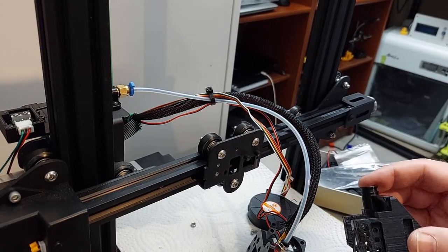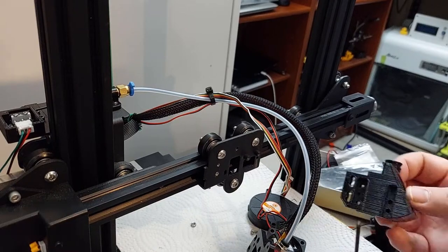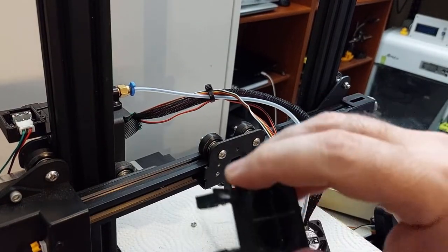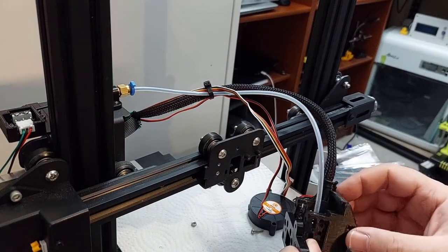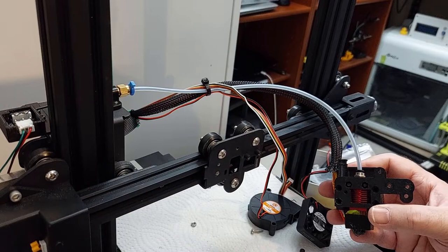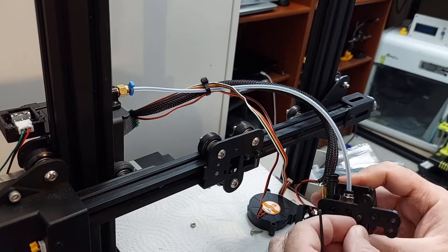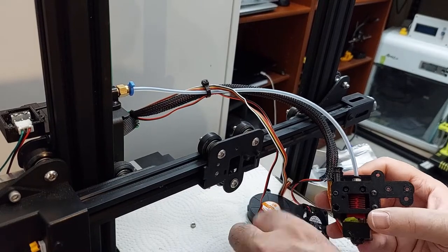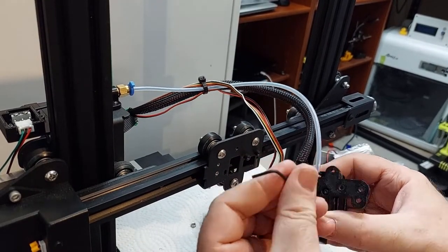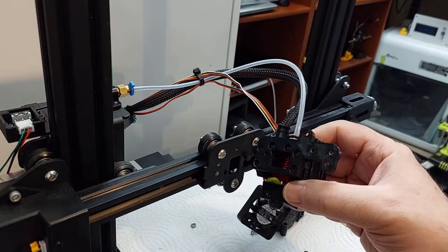Your bracket is going to have screws — three on each side. You're probably going to have to have a screw put in here at some point, but we'll deal with that in a minute. Now notice that your channel is right there for your wires, so make sure everything slides in nice and neat, just like that. Then we're just going to attach these with M3 10s. Just make sure those are snug. That's that part of the assembly.